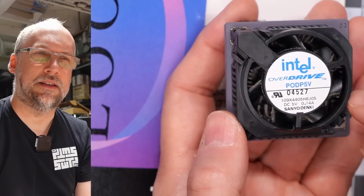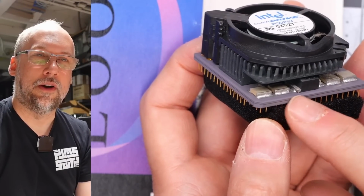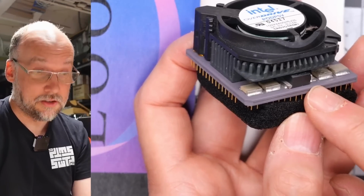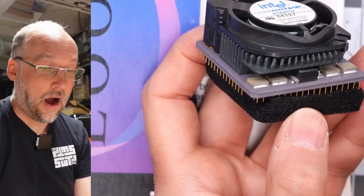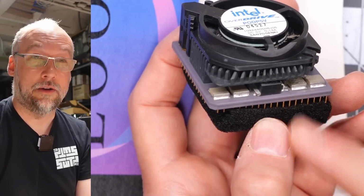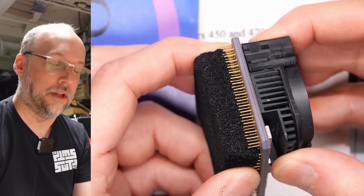It didn't have that exact same sticker, but there's definitely a little dust on there. And then what you see going on right here are the voltage regulation circuits, because it is really a Pentium here with the I/O for a 486, and it requires 3.3 volts and some I/O stuff like that. So this is the voltage regulation for that, plus the built-in cooling.